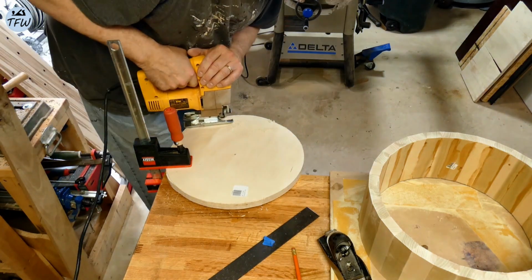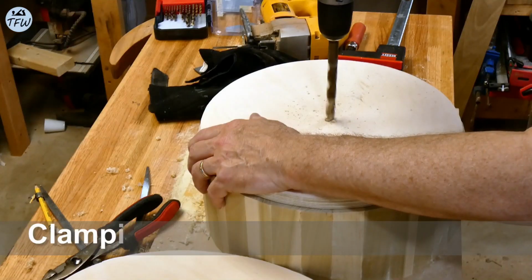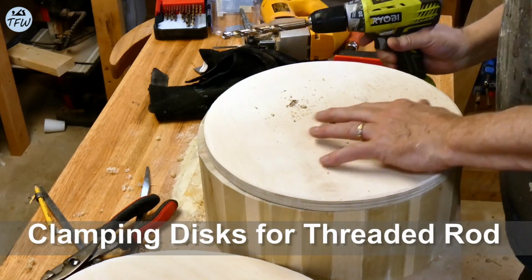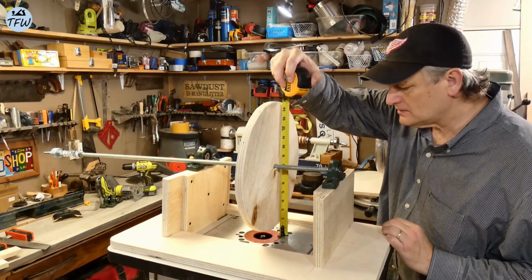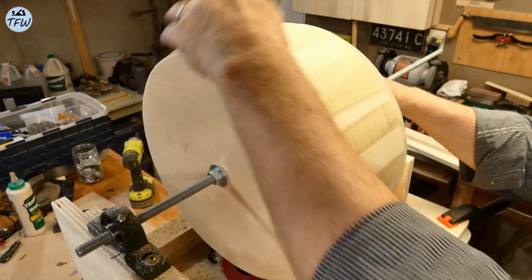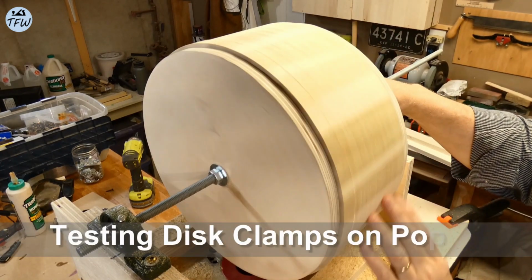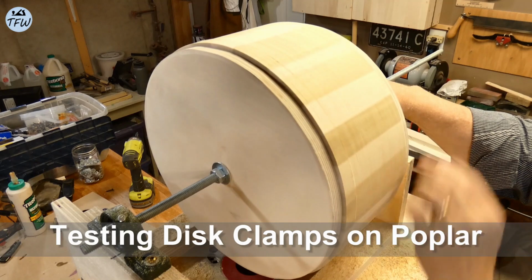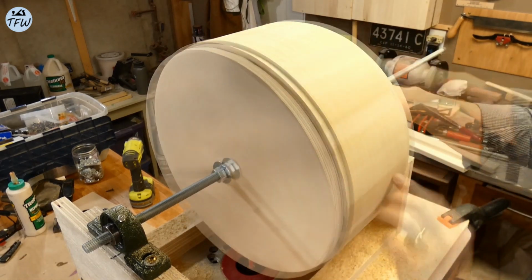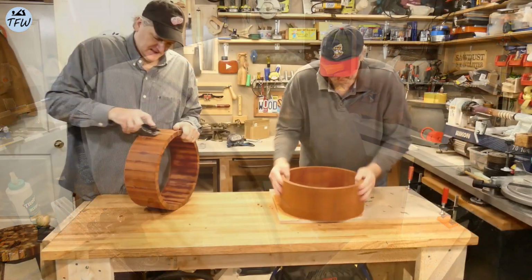And so I'm going to need a couple of circle cutouts here that are just a little bit less in width than the outer dimensions of the shell. So I made these 2 plywood discs at 13.5 inches. And using some double-faced tape, I'm able to put those 2 plywood discs on both sides of the shell and then add some nuts and washers to squeeze both sides on top of the shell and now it'll spin freely over the top of my cutting head.